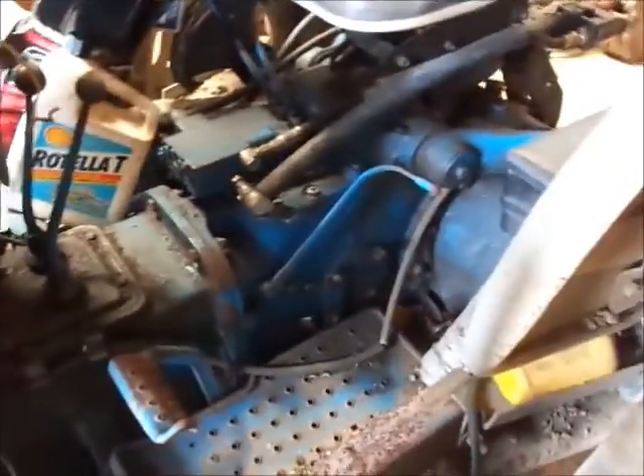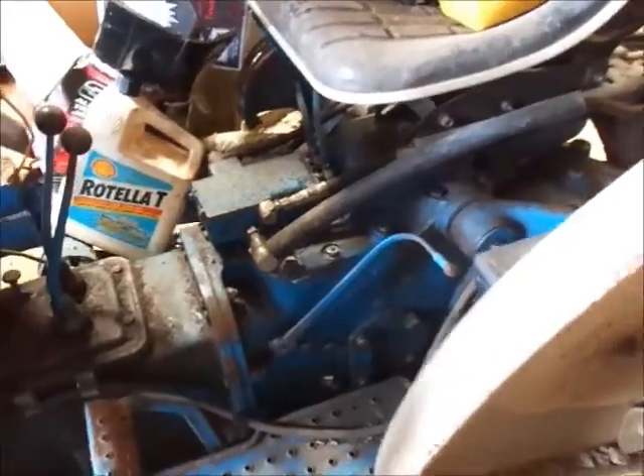All we can do is go for broke. The fuel shutoff moves freely, the rack doesn't seem like it's stuck, so all I can do is just see what happens. Let me get the seat cleared off so I can sit on it and then I'll bring you guys back down and see what happens. I got lights on the dash — one of them should be glow plugs. Let's see if one cycles out here real quick.